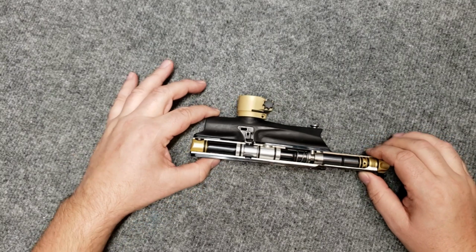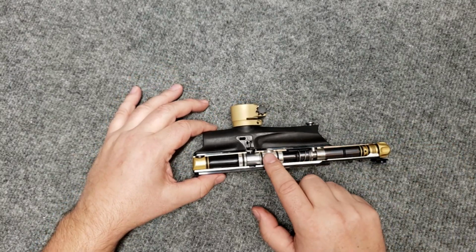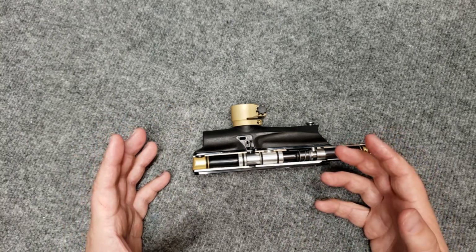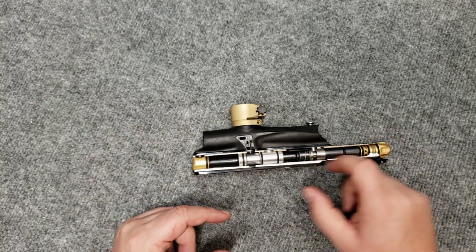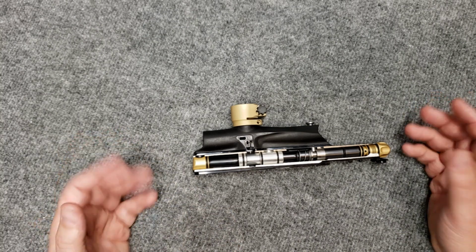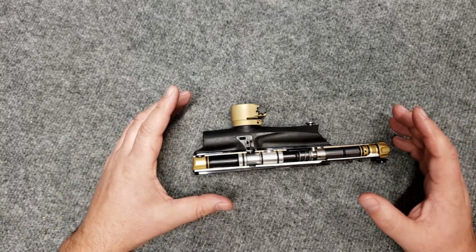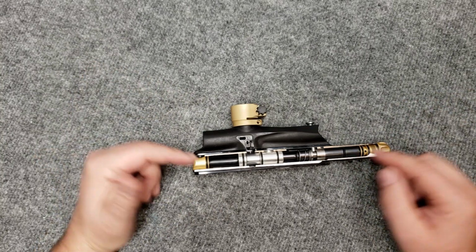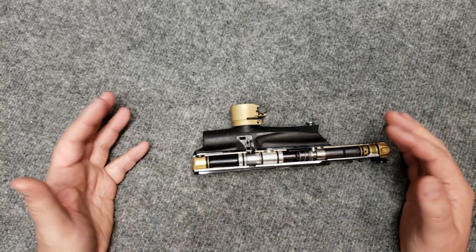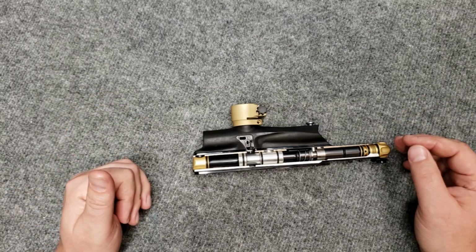I am going to show you how to take out the mid-body valve. Now the valve in the J4 Torque doesn't move. All it does is allow the O-rings to seal and unseal in the body in a removable component. The disassembly of this is actually rather easy, just to take out the valve and the front plug, but there's a few tricks in there. We want to make sure you understand just how easy it is, but also what to watch out for.